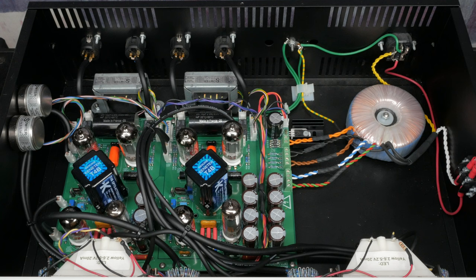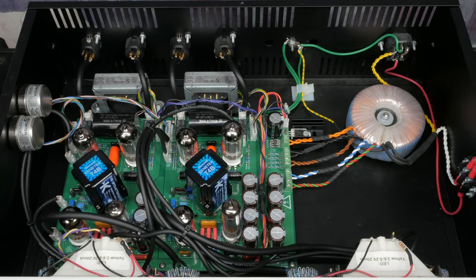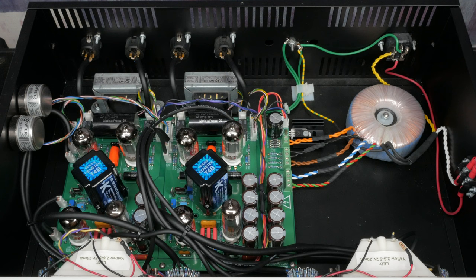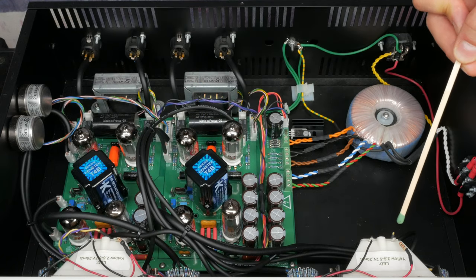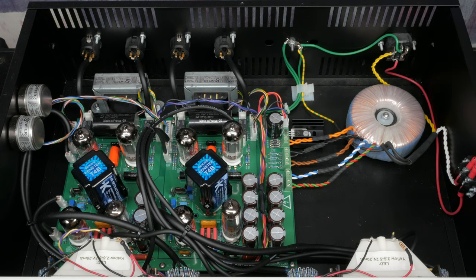You then connect the negative terminal of this VU to channel 2's VU. You'll also need to connect the 5-volt relay located on the top corner of the board to the bypass terminal of the in/bypass toggle on channel 1. Run a wire from the toggle to a 100 ohm resistor. On the same side of the resistor, connect another red wire to another 100 ohm resistor. Attach the unconnected sides of each 100 ohm resistor to their respective positive terminal on the VU meter.